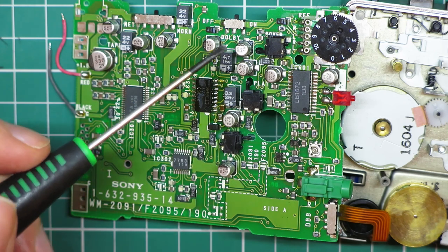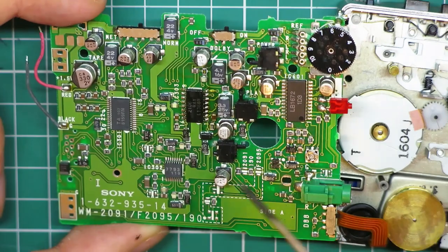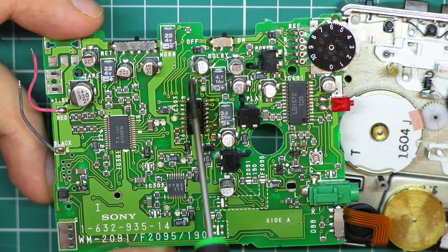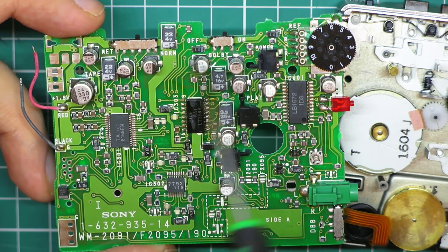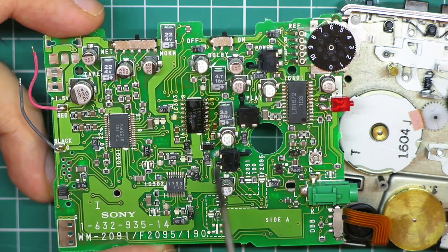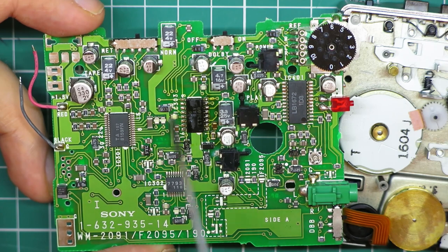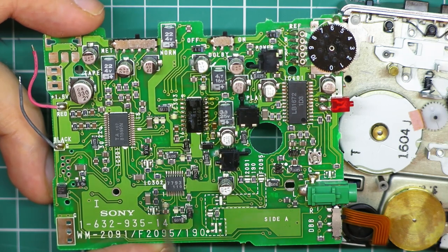I haven't seen one of these yet with heavily excessive leakage that's corroded the board or anything like that. I can see on one of the little capacitors, I think this one here, I don't know if you can see that, that solder joint looks kind of dull. And that, I think, is about the worst sign I'd seen that these were failing. These are from about 1990, 1991, so it's in the early days of surface mount capacitors. The technology was in its infancy, in the consumer space at least, and it didn't stand the test of time ever so well. There were other consumer electronics that suffered way more extensively, as in board damage, from these. I haven't seen it on one of these yet. There is a bit of a sticky substance around here, but it doesn't look corrosive, and it doesn't smell of anything. It might be flux.